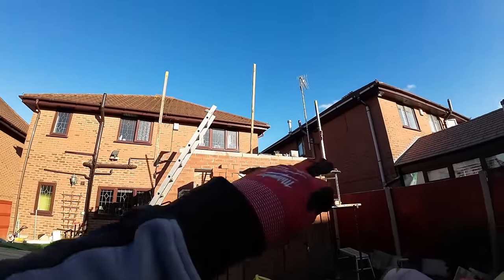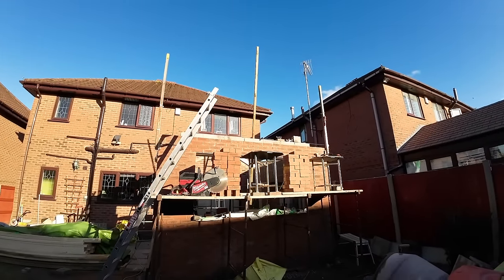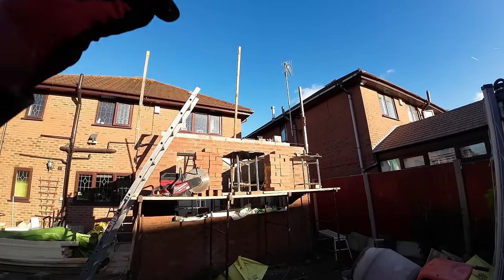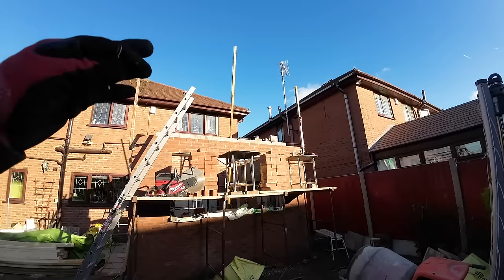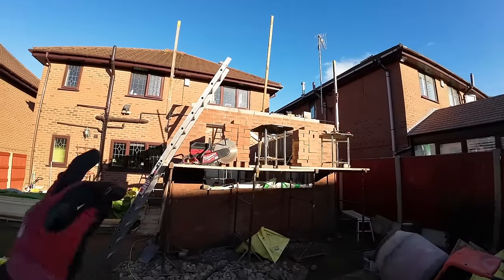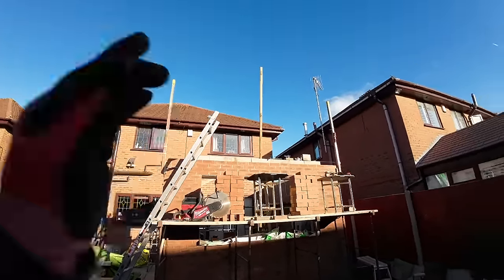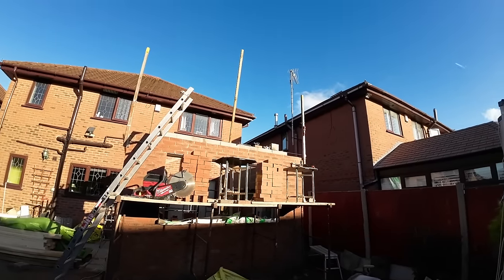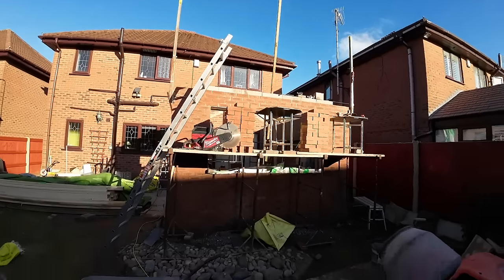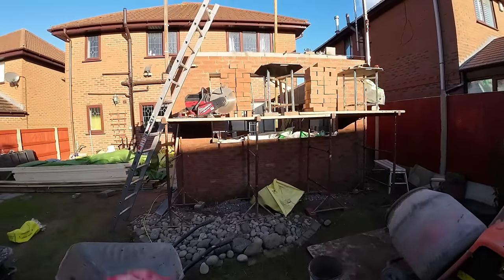But the first thing we want to be doing is getting the block work up while it's overhand. And it's the full width scaffold. See, I'm making this up as I go along here. Yeah, we've got to get the block work up first, as high as we can. Then we do the face work and insulate it as we go. Then as soon as we're up as high as we can, we're going to drop all this. That can go home then. And we're going to jump on the scaffold on the inside and work from the inside, because by then we're going to come in a bit and come in a bit, so we'll be all right then for width on the inside, because those towers are not a lot narrower.